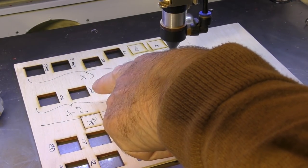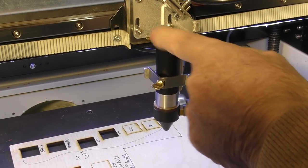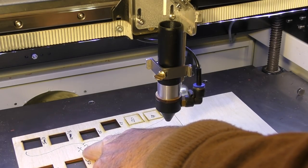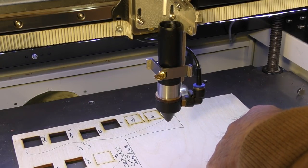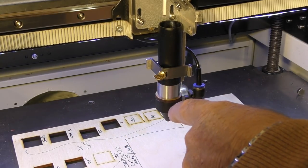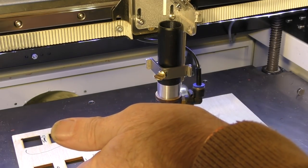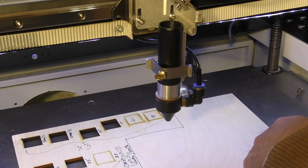And it subscribes towards the principles that I was working with in my RDWorks learning session, where we were playing with a 7.5-inch lens here and a 2.5-inch lens here, and managed to get a 30% increase in cutting ability. Not because we were expanding the beam, but because we were condensing the beam before it went through a 2.5-inch lens. So I think this general idea about compressing the beam to put it through a lens to make it more efficient at cutting is probably something we shall further investigate and prove as a real possibility. Because, hey, if you can get 30% more speed out of the same tube by just changing your lenses, it's much cheaper to buy two lenses than it is to buy a big expensive tube.